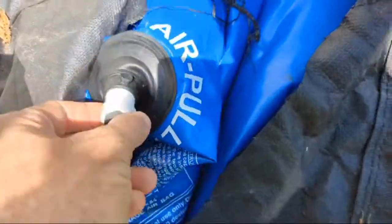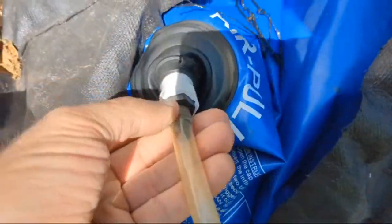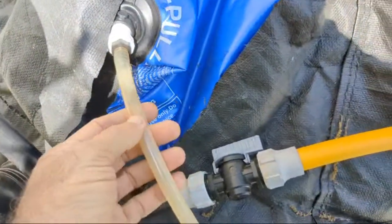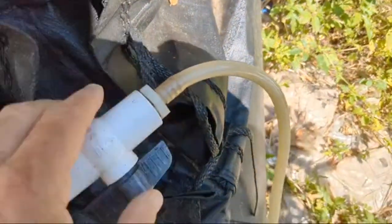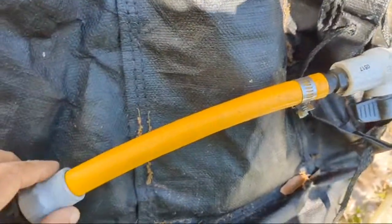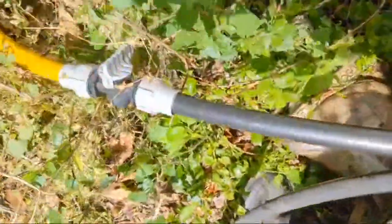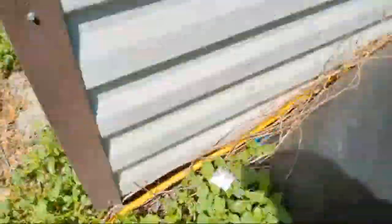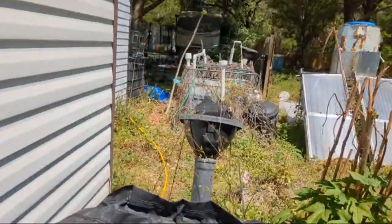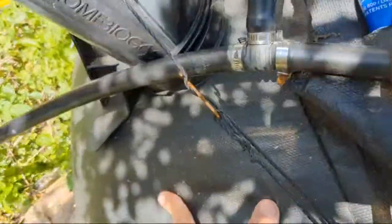You can see that's what John fixed up into the dunnage bag on this one — a different fitting here, very simple. I had to then use a hose coming into a valve, then getting into the part that came with the home biogas unit here with a clamp. And then I've put a valve here and a valve down here. This one is what's going out to the other bag and off to the cook stove, but the gas comes here.